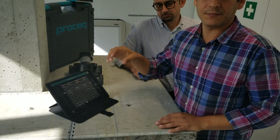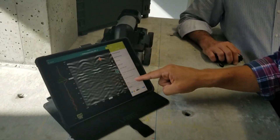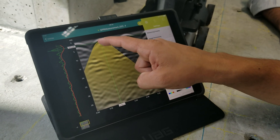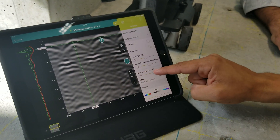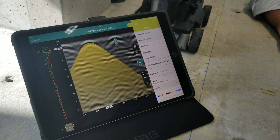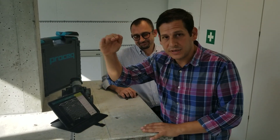One other way you can do this — not everybody may have the function to go in and identify the depth and put that actual depth in there. So the alternative, if you don't have that feature on your GPR, is you can do a hyperbola fit like I've discussed often and move your hyperbola to where the peak of the envelope is. Then you can see my 2.1 centimeters — I can just adjust this using my dielectric constant until I go to 2.3 centimeters, which is equivalent to 23 millimeters. And now it's done, it's adjusted. So you can do it either with a setting that says here's the depth, or you can use your dielectric constant and adjust it until your response appears at that depth.